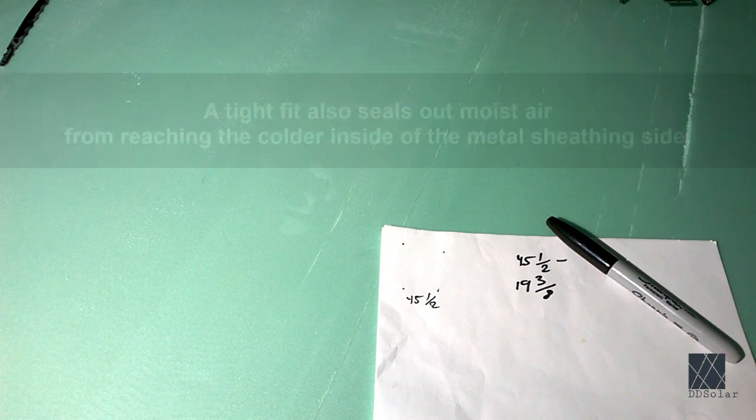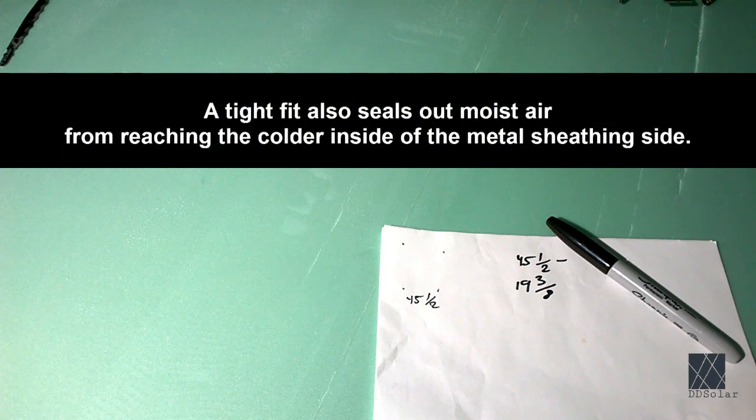Normally, you want to secure your insulation with some strapping or furring strips or something. In this case, because I'm working alone and I'm pressed for time, I went ahead and just cut the foam board deliberately bigger than it should have been, and I used a piece of wood and a hammer to hammer it forcefully in between the metal posts in the building.